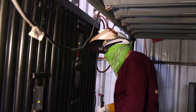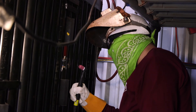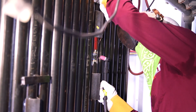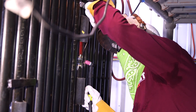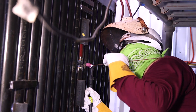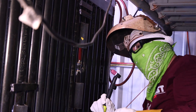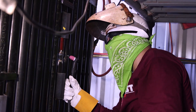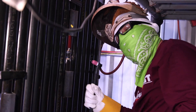My partner just finished his side of the root — closed it up. Now it's my turn to do my hot pass on my backside. What I'm going to do is put my wire on top and let it drip down in there, building something up that I can catch on — enough to fill up the tube on my side. Then from there I'm going to start filling it up. I keep my tungsten at a good stick-out length so I can get as much of his side as I can, so he can catch it good on his end.